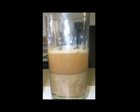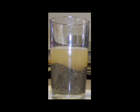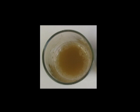Wait approximately 30 minutes. If the water is very cloudy, turns a very dark color, or has a lot of debris floating — for example, scum, foam, or coal — you have poor quality sand and may need to reject it, or at minimum have it tested properly. If after settling the water is a light tan with minimal floating sediment, your sand is probably well washed and you're ready to go.